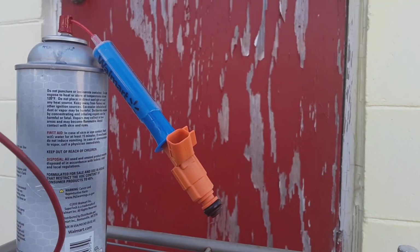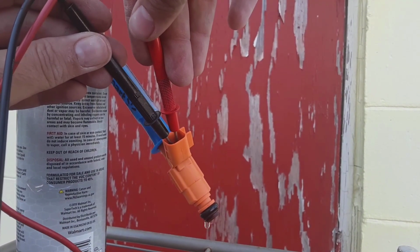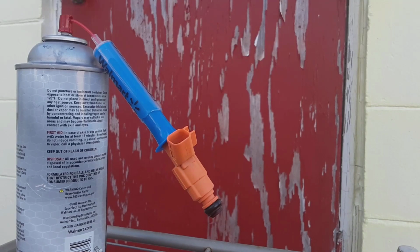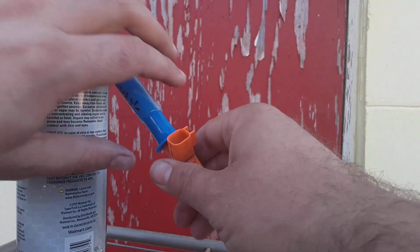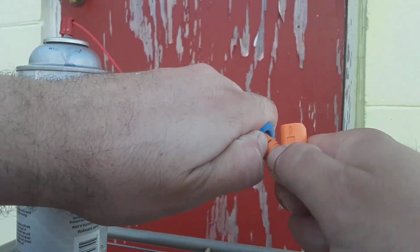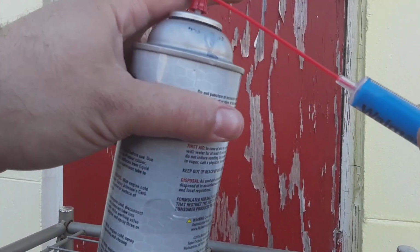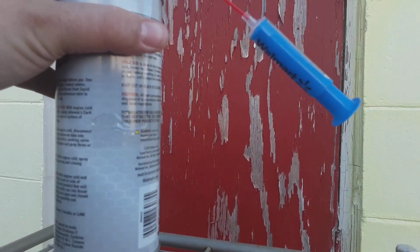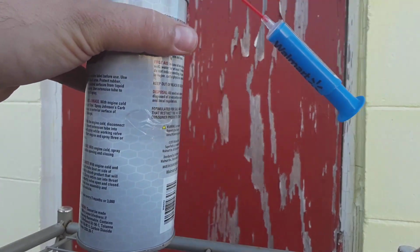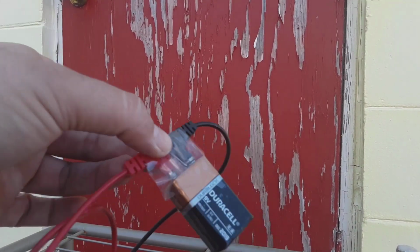And this will be the last one right here. You need a couple clicks to get it through. Now, see all that stuff's still in there? Now this little chamber, like I said, they give out these at Walmart for free. So all I needed was this and that, and it got me a fuel injector cleaner. You need a 9-volt battery also, and like I said, I'll use the leads off of my digital voltmeter.